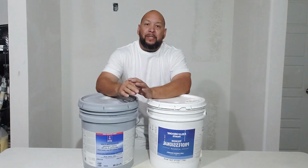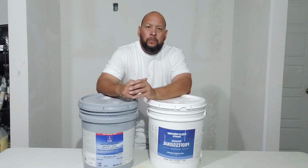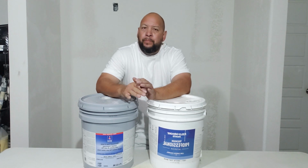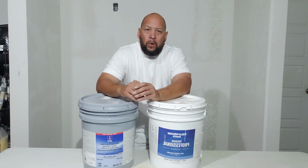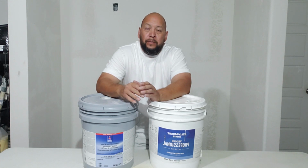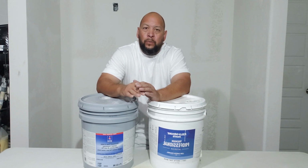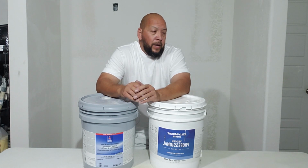Okay, so before we actually start getting set up, let's talk about a couple things that you're going to want to put on the walls first. Let me ask you a question. Have you ever been to a house or seen someone's video where the paint starts peeling off the wall? Well, there are a couple of reasons. One, they sanded it and didn't wipe the walls down, so it's all dusty, and they didn't use a good primer or PVA. And I'm going to explain that right now.